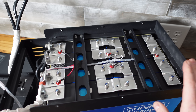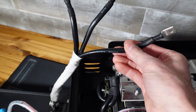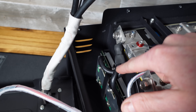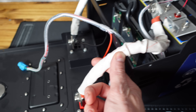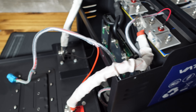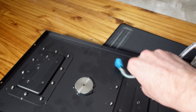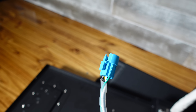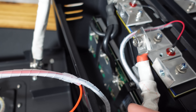Let's unpack what we see here because there's a lot going on. On the negative side coming off the BMS we have three 6-gauge silicone-insulated wires — that's a 200°C insulation rating — and three more of the same size going from the BMS to the negative post. Positive is a single number-1-gauge silicone-insulated wire going from the positive terminal to the positive output post. There are also smaller positive and negative wires after the BMS going up to the front switch connector — those power the indicator LED. Two white leads in heat shrink go down into the BMS as the on-off switch.